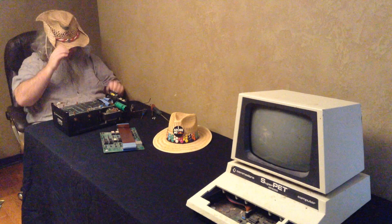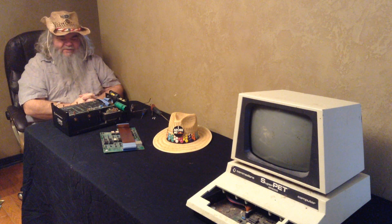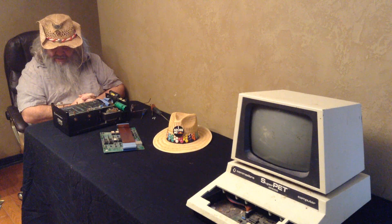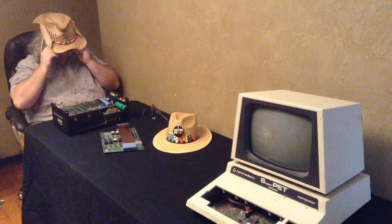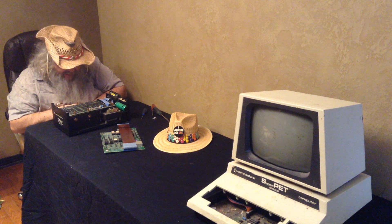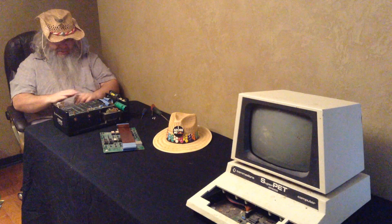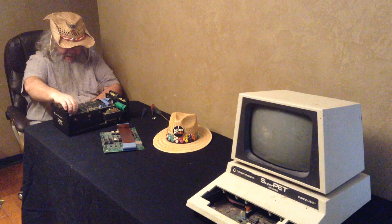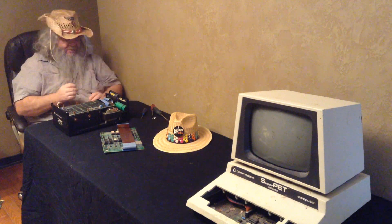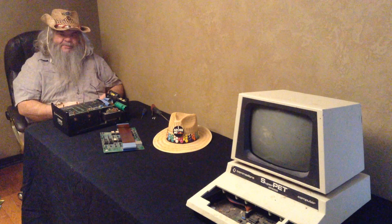It is time to take a deep breath, and I'm thankful that nothing I've done so far seems to have damaged anything. Interesting to see there's an awful lot of little chips in here - some of them socketed, many of them not. This whole board is just full of chips, packed in tight. I'm thinking that this whole bottom part would have been the drive from the manufacturer, and the upper board would be what allows it to communicate with the Super PETs, 8032s, 2001s, 4032s, 4016s, and others - the B series, the IEEE, or the Commodore 64 with an IEEE interface.